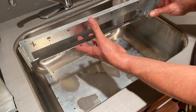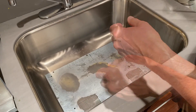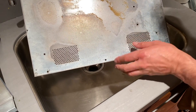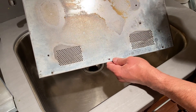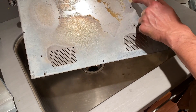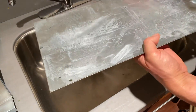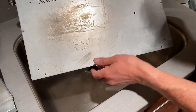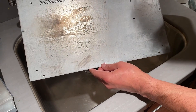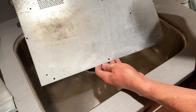This one should be fine — I don't see any signs of rust on it. And this big sheet here, you can clearly see where the heavy oxidation took place and where I went a little heavy on the removal of the oxidation with the abrasives. You can see here and here and here the galvanization has been removed, so we'll need to touch this up. This whole side will be treated, and I might do the other side as well, although I'm just getting powder there, which isn't necessarily indicative of a problem — sometimes the galvanization itself will do that and it's not allowing any rust. But I'll probably do both sides just to make this look nice.